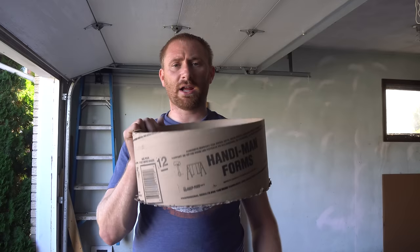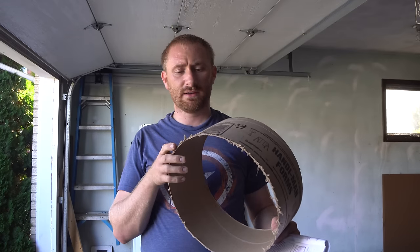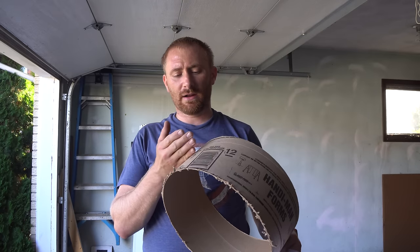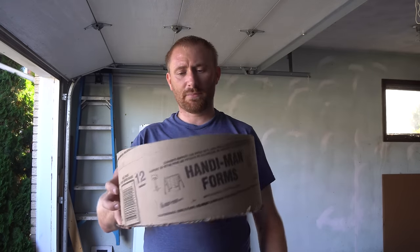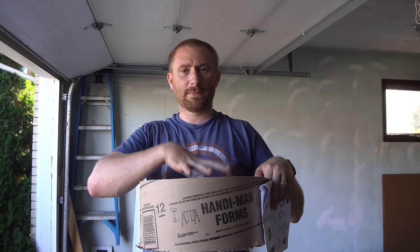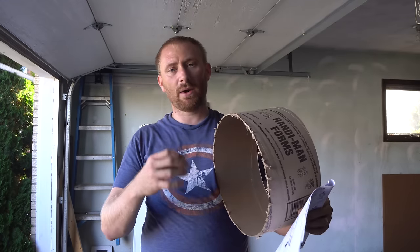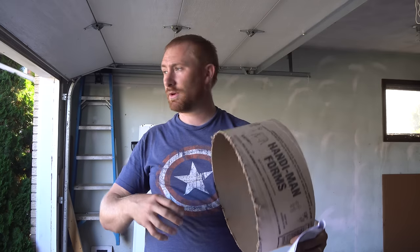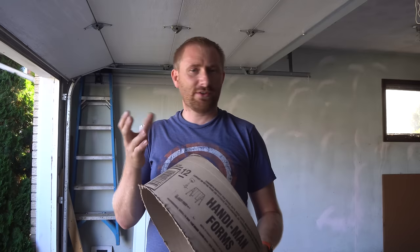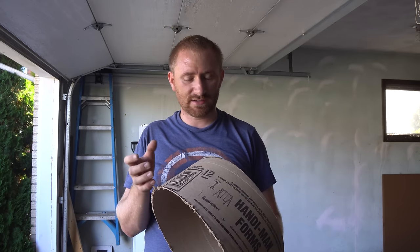However, I'm going to cut this down to 4 inches rather than 6, so that it's thicker right at that 4-inch mark. Maybe to let it come up a little higher around it, but that way I get a really nice small footprint right up top. But the anchors that go down, I want it in thicker concrete down below. So I'm gonna make this smaller, and you don't even have to do 4 inches. You could definitely do less than that.